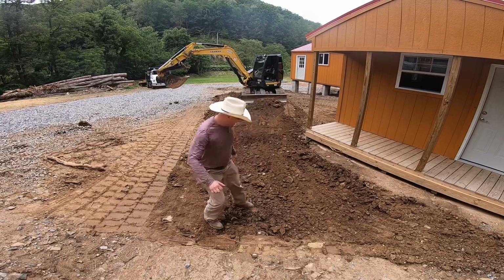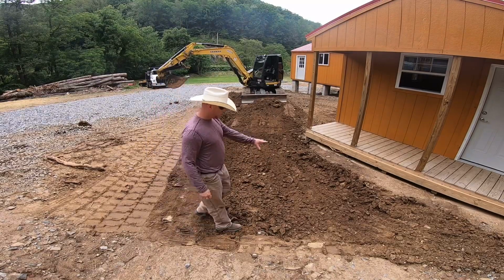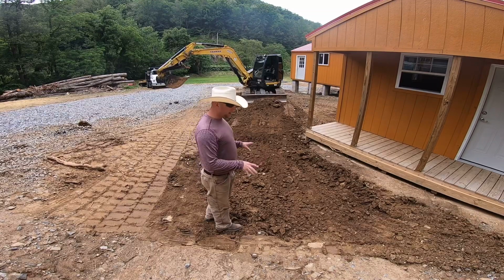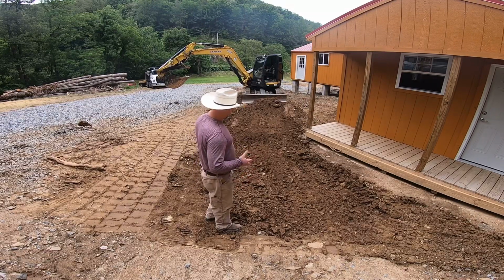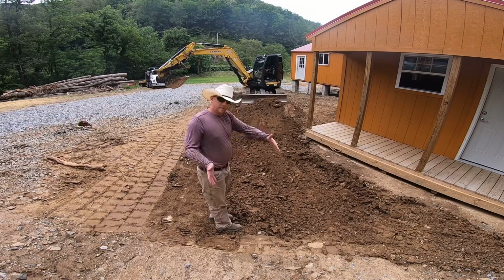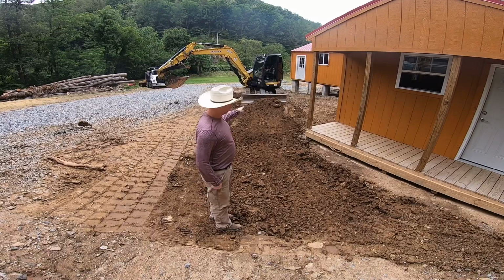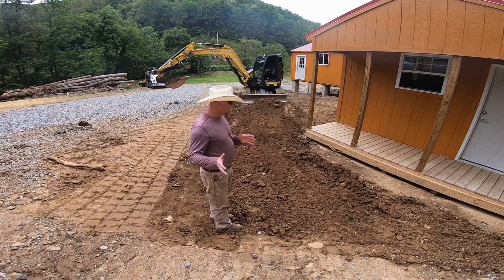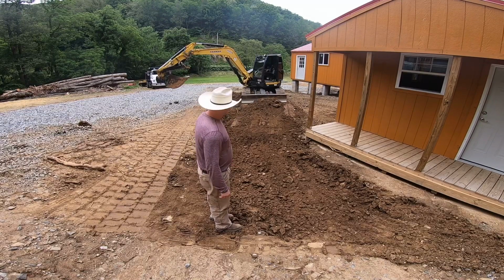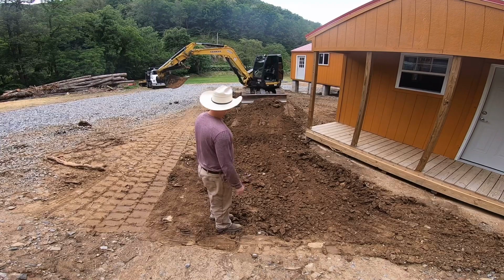So what we've got now is I've got my grade on this side the way I wanted. This side didn't go exactly how I wanted the first time, so I backed up and got my rough grade in here, and you see that one patch where I put that blade down and back dragged. That's the grade that I want, and that's my guide. So now all I've got to do is keep backing the machine out and following that grade as if I'm letting water follow me out. So we've got our grade, now we just have to finish it.